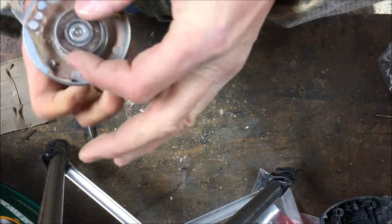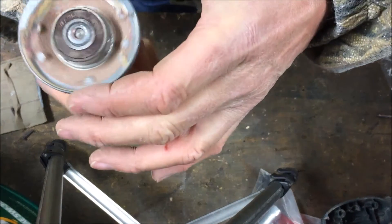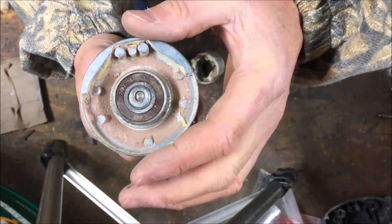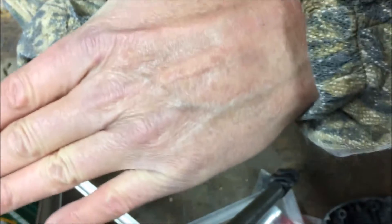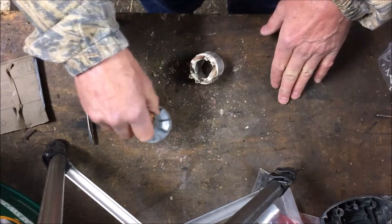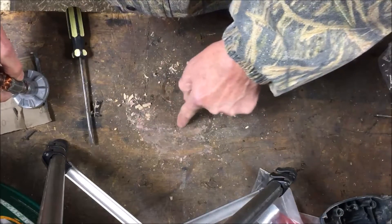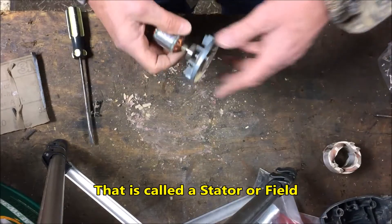As the motor spins, since this part is not centered — it's drilled off center — it's going to move it this way. I'll exaggerate this: as the motor is spinning, since this is drilled off center, it's going to move it this way. This was attached to that pad, so it's going to make the pad oscillate several thousand times a minute. That's how those things work. In fact, if you lay the sander on a painted surface, turn it on, then turn it off and lift it, you'll see micro-abrasions in circular patterns. That's how these sanders work, and they work really well.